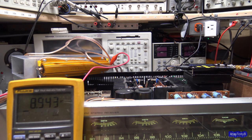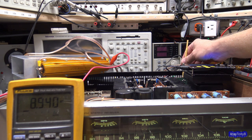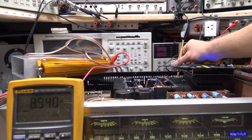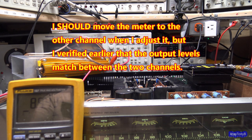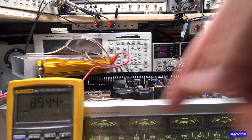and these resistors will get hot if you have too small of a resistor. I'm just going to turn this down or up until I get 10 watts. So there we go. We got 10 watts there. And then I'm going to go to this one. I'm going to go to 10 watts there. And that pot is a little bit dirty, so I better spray it with something. And there you go. So if it's too jumpy, we might have to clean the potentiometer. I can spray it with some contact or control cleaner. But there it is. Now it's 10 watts.